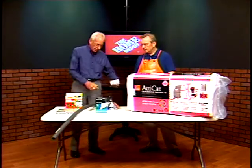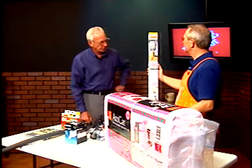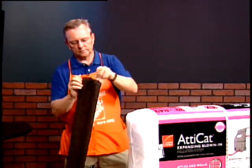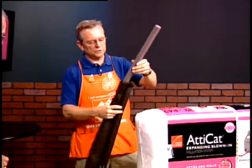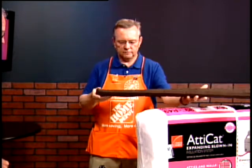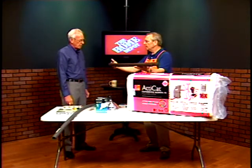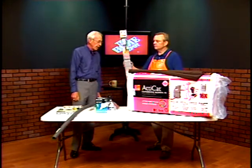Here's something I've got at my house on two doors, and it works. It's called the double draft stop. You take it, pull it out of the package, and you can cut it to the size that you need — they come in 36-inch. You slide it back in, zip it up, and then slide it under the door. It'll slide and move with the door as it opens and closes, and it'll kill your drafts. A lot of people use towels, but towels don't go back when you close the door. This follows the track of the door and stops that draft. You can buy it at Home Depot.